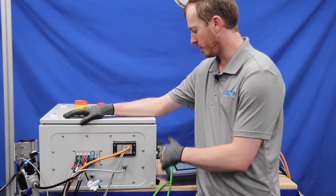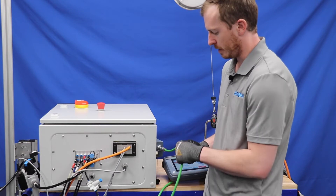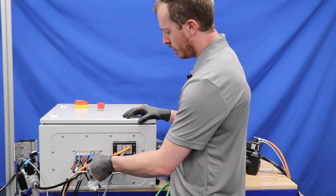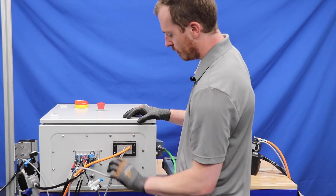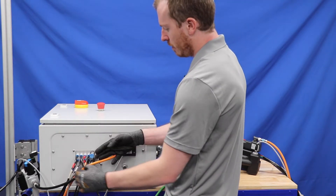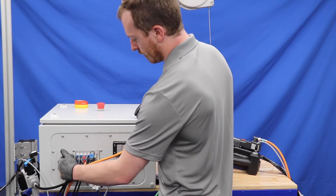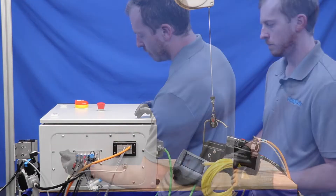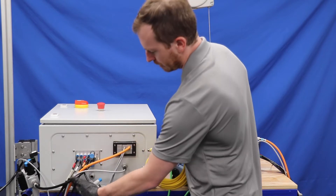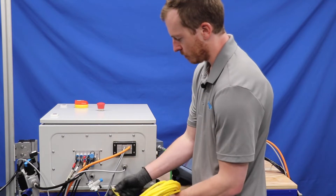On the controller there are several cables and tubing that feed into it. The green cable is for the HMI, the orange cable is for the tool motor, and the gray cable is for the tool data. Then there is the pneumatic valve bank. Note that the different pneumatic tubings have tape on them to designate which location they go into the valve bank. The optional cutoff signal and foot switch are accessible at these two points here.